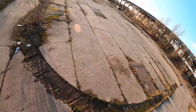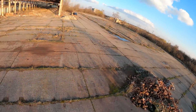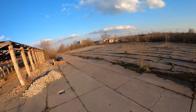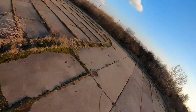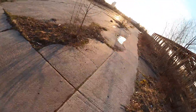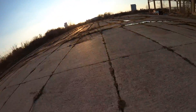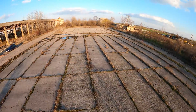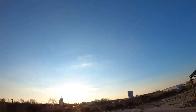I'm going to dedicate a full day where I go out, do the slight tune, and also do a proper tune where we actually ruin the complete tune and play around with the settings. I'm also planning on comparing default Betaflight versus Emuflight versus whatever other firmware I find, to see how well that holds out — I think it'll make for a really interesting video on this quadcopter. It's going to be kind of like a testing platform and at the same time cinematography. With the GoPro on, it seems like it flies slightly worse due to the extra weight. You're going to have to stick an HD camera on to know how well your quad is doing in the air, and obviously the black box log really does help.